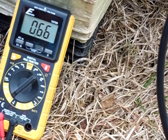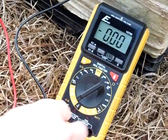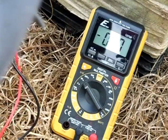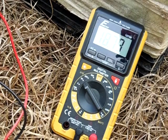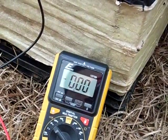I'll come back in a couple minutes and check it while the sun is shining. I'll shut the camera off to save some battery, and we'll get on it when the sun's shining. There you go — 18.8 volts. So that's enough to actually charge up your battery; you've got to have at least 14.5 volts to charge your battery. We'll wait for the sun to come back out from behind the clouds so you guys can see — come back and check the voltage and amps again.